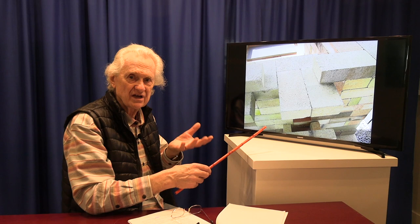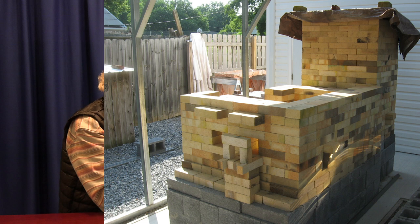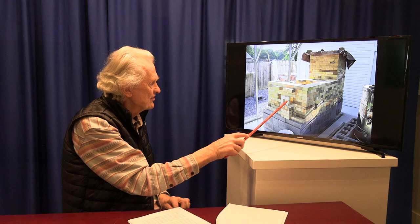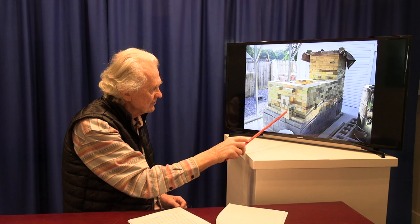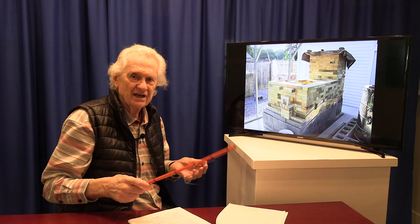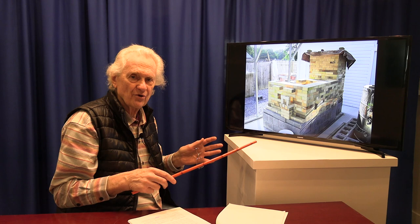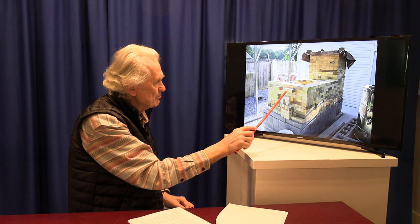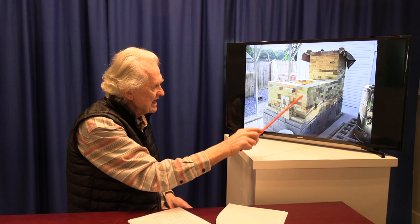By turning two bricks sideways, we created a half-brick-long shelf located below the soda ports - a burner port is down below. We've built the chimney and end walls higher now. We've built up the two burner ports and also a preliminary mock-up of burner port extensions - little tunnels that sit outside the kiln. Here are the two protective shelves that will protrude below the soda ports. At this point we've built both end walls to about two-thirds or three-quarters of their final height.